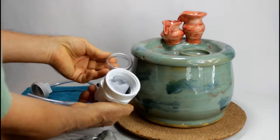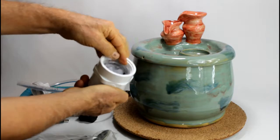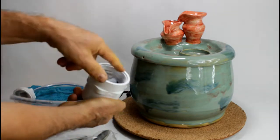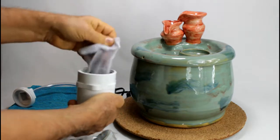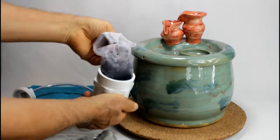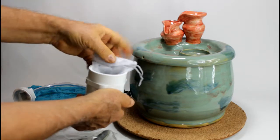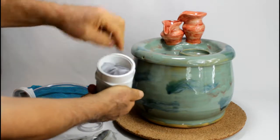So let's see what's inside. You have this ring — it's just a safety measure so that the thread, when you pull the cap or lid in, doesn't catch the media bag and block. Here is the media bag; it's full of charcoal. And the filter housing — the media bag has a drawstring, you can roll it in and put it inside.